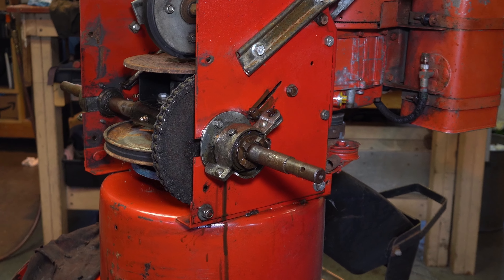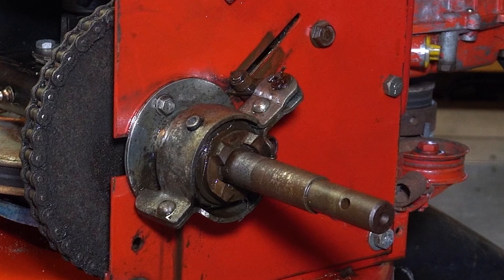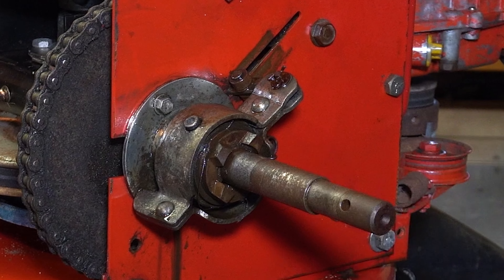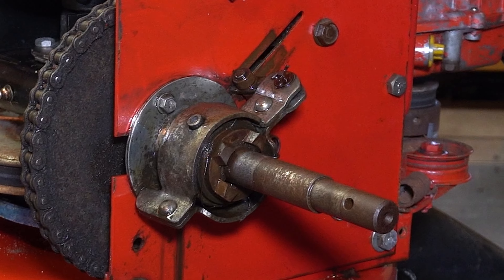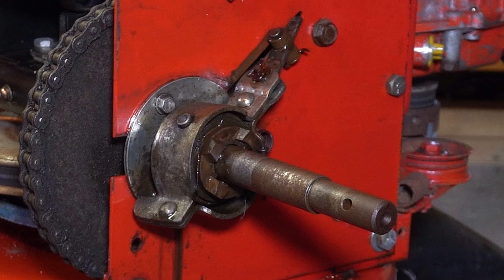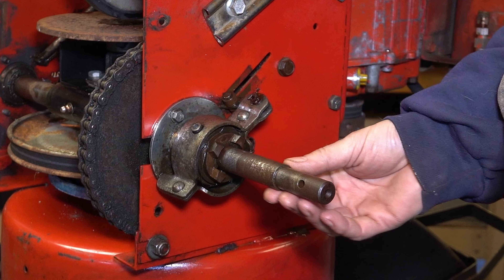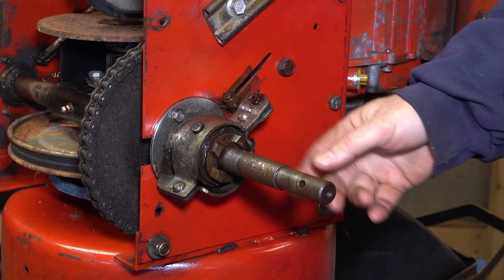I work the oil in. The levers are up top—we'll show you them in a minute. I can put the spring back in a bit that I took off, so just good motor oil. We've got to spin these shafts, but we can't do that yet. I've got to put something through this hole. We'll clean the shafts off next. We'll come back with our chain wax—chain wax is what we'll use on this one, because we want more of a grease. Let me clean these off first; they're pretty nasty. I'm going to do a wire wheel and then get my crocus cloth.